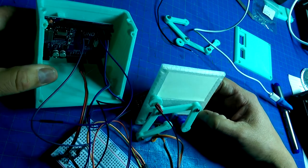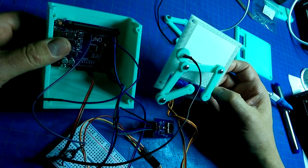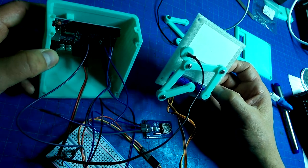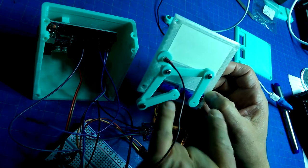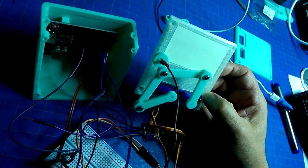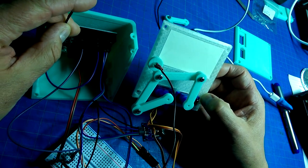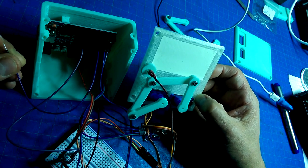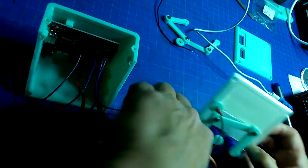It's fairly simple. It takes an Arduino Uno to do the servo control. You could use any microcontroller, really, but the code is for an Arduino. It doesn't have to be an Uno, because you really only need four pins. Two pins to control your servos, one pin to control your LED, and another pin that you can use to trigger when you're going to write out the time. You could also set it up so that it'll write out the time every minute. I think that's what the whiteboard project did. But in any event, those are the things you need.